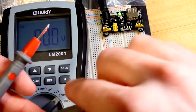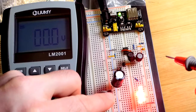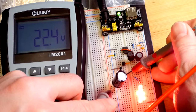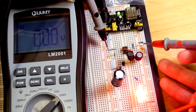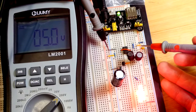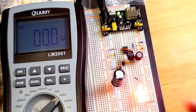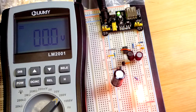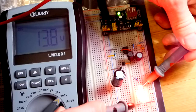In this video we're going to look at this circuit. First, let's look at the voltage of this capacitor — it is 22.4 volts, which by itself would not be too exciting, except the power supply we're using is a breadboard power supply and it's only a 5-volt supply. So I was able to build a voltage booster with components I already have. This is 1, 2, 3, 4, 5, 6, 7 LEDs in series, so they're blocking about 14 volts in that range. We can look at the voltage they are blocking right here, and as you can tell they're pretty bright.